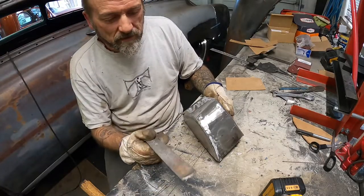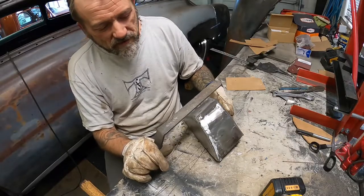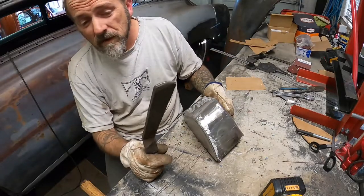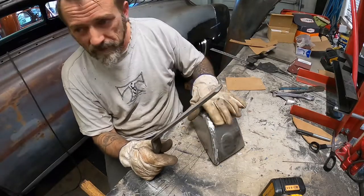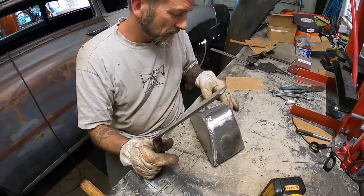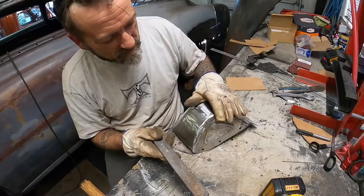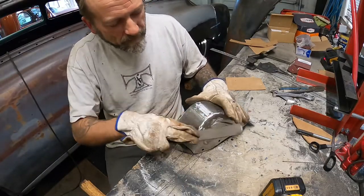this is how I do it anyway. I get my slapper, which is actually just a big engineering file that I bought years ago and heated up and bent a handle into it, but it's still a good file. Actually, it's the sharpest file I had, as the rest of my files are all pretty stuffed. Hint, hint. Okay, so what I'm getting at is here, where I cut all these little reliefs to get these curves and radiuses on the side here, I run the file across the top.